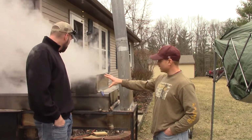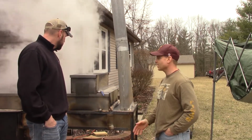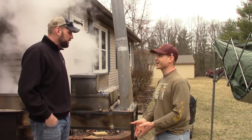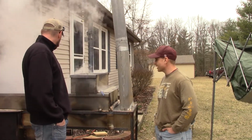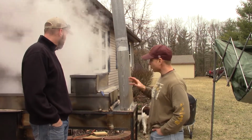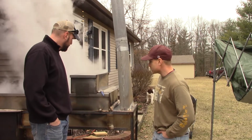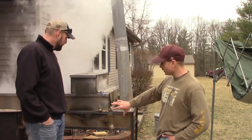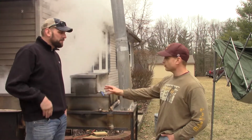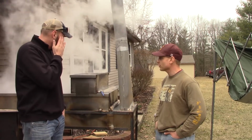So when I did the heater, I almost did it 24 wide, just like my bottom pan, and then realized, hey, if I do that, it's going to drop right in there. So last minute, I was able to keep myself from doing that. With this right here, it's amazing. I've got ceramic blanket lining the whole inside of the heater. I've got fire brick, cemented, and lined inside of that with the ceramic blanket as well.